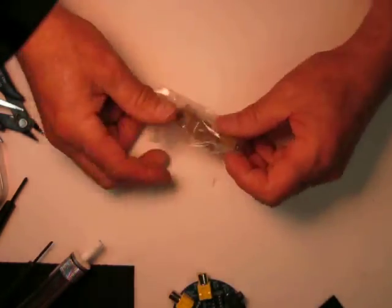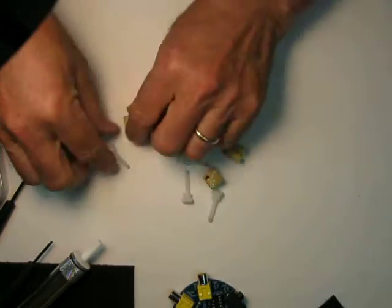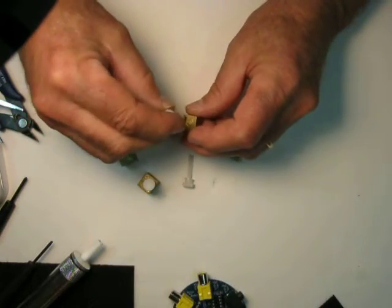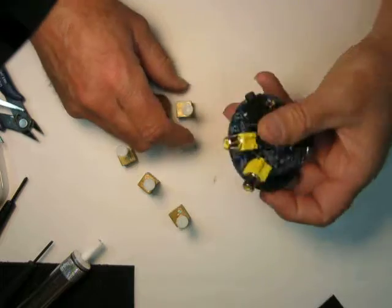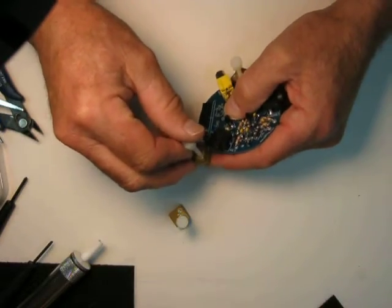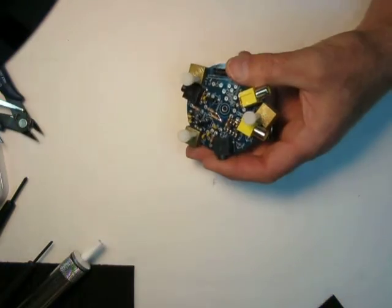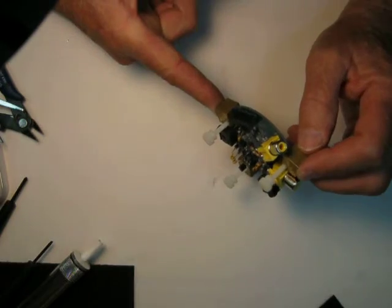And the most important thing was this little thing right here. This is the latest from QRPME. I call this a brass set. All we have is four solid brass little cubes. They have slots milled in them with a threaded hole. The neat thing about these guys is you can just find any space on the board, slide the slot in there, tighten that up. I'll put one over here and then I'll put one over here. When I'm doing a little round tuna can board, I only need three of them for a tripod. Now I can put parts in the board, and those threaded thumb screws stand up.